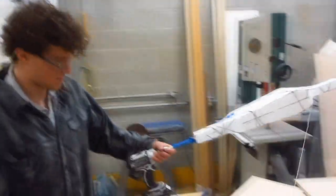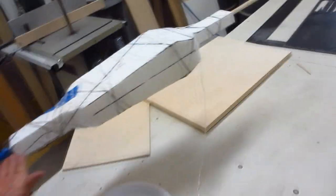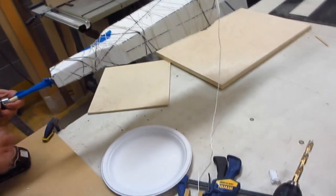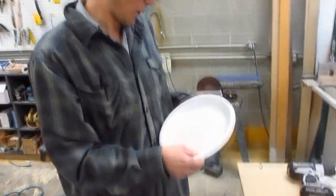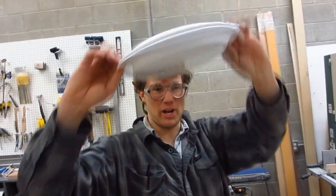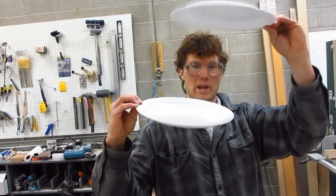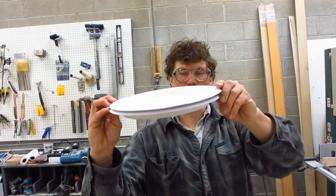What we do here is we actually cut the thing off of the mandrel. After this has been cured and hardened into a totally rigid shell, we can then sever the halves to create two halves. We basically have a 3D shape — a shell — that we've produced using our mandrel. There are two opposite shapes, and once we cut it off the mandrel and separate it into two pieces, we now have a composite that, after we flip it, will actually fit and be congruent with one another.